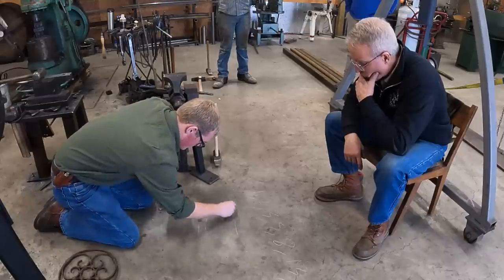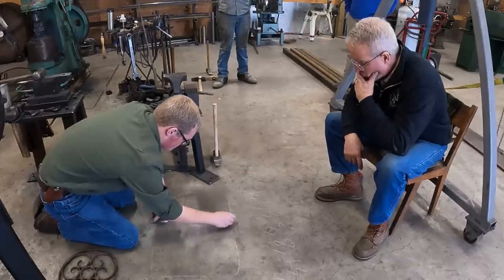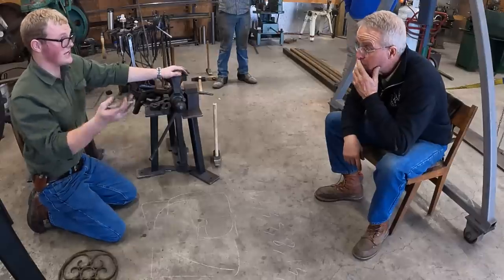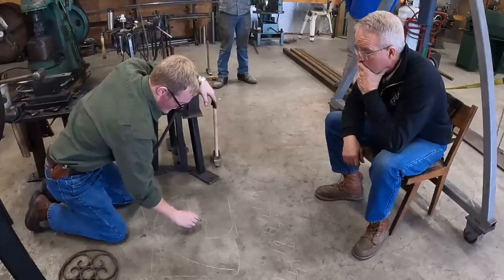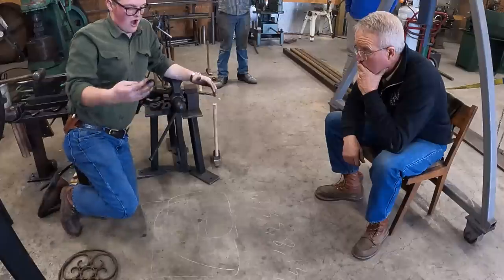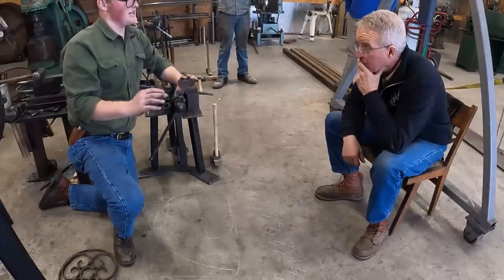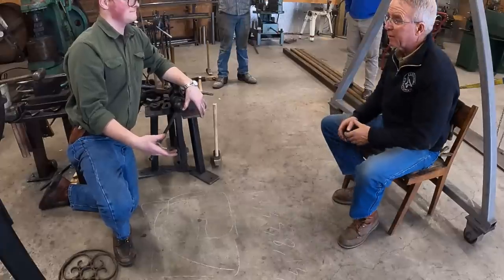As Jonathan was describing to me how he arrived at the lengths to cut out of a 10-foot piece of bar stock in order to get the 24-inch diameter trivet, he immediately began to talk about the golden mean, the golden proportion, and the Fibonacci sequence as a way to arrive at those ideal appearances. So I created a jig off of the Fibonacci numbers, taking it at 1 inch, so 1 inch by 1 inch, 2 inches, 3 inches, and so on. And then I made that jig, and then off of that jig, I made another jig, hot scrolled it onto this fixture to make a standard scrolling jig off of those numbers.